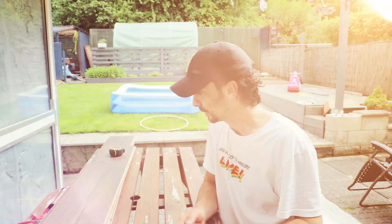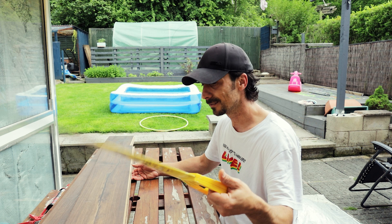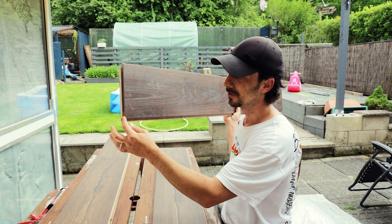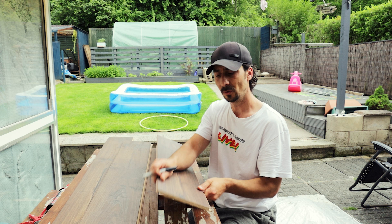Before I start, you don't need any special tools - just something to cut with, no electrical saw needed, it's just laminate. The first thing to do is cut off the connector sides on both edges of each board, since those are the interlocking tabs. Cut from the top face of the laminate, not the back, because cutting from the back risks breaking the texture on the surface. Not a big deal at the end of the tabletop, but it's nice to keep it clean.